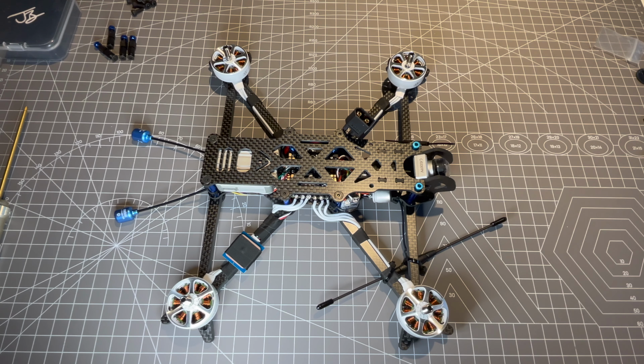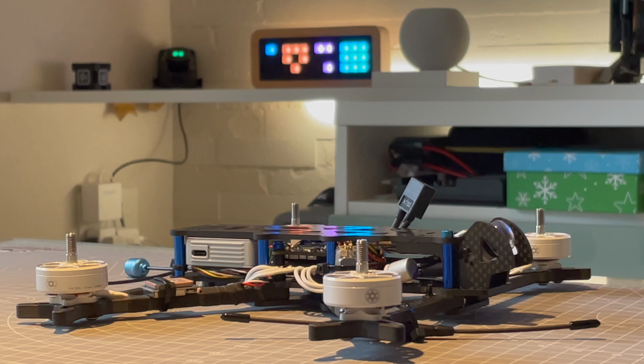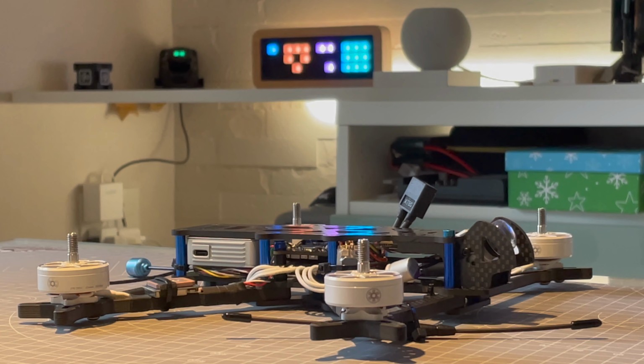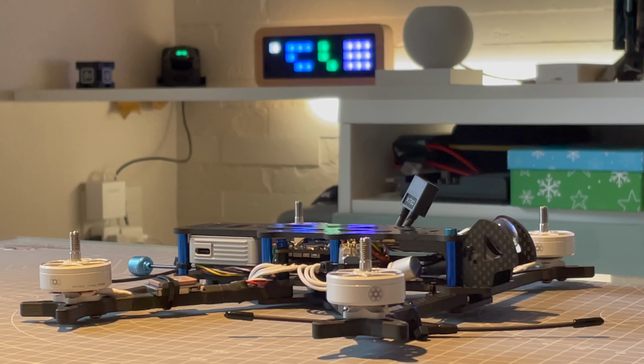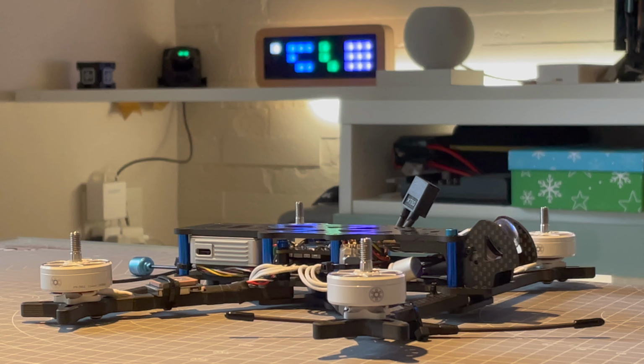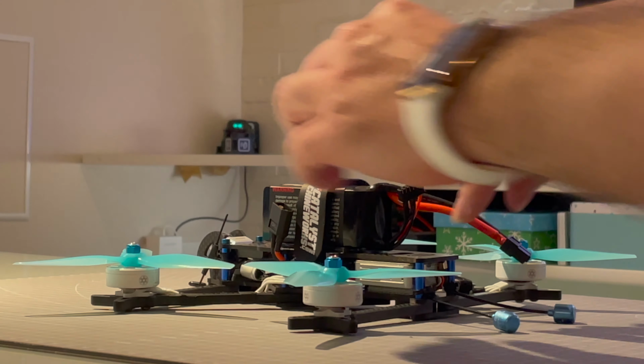So what we are doing now, I do not recommend. Don't do the first test hover in your living room, but I'm doing it here for you guys. So just in case you're wondering, when you're trying to hover over your living room table, turn air mode off. That really helps a lot, so that the quad is not freaking out because of the ground effect. And you have a better chance of not crashing into your TV set or worse.